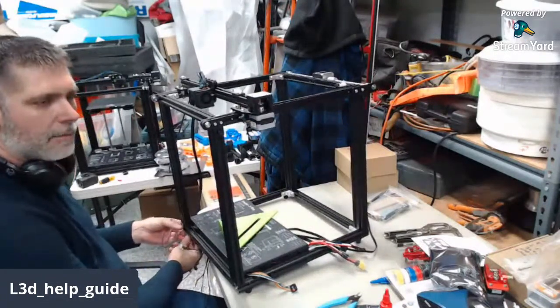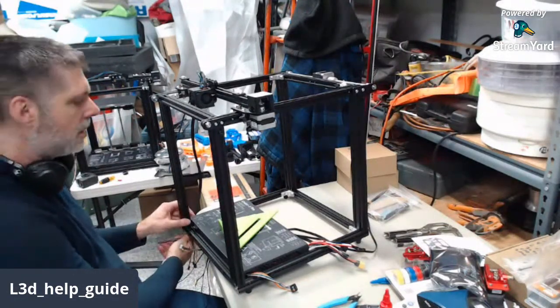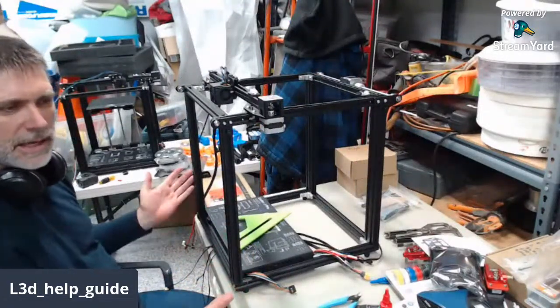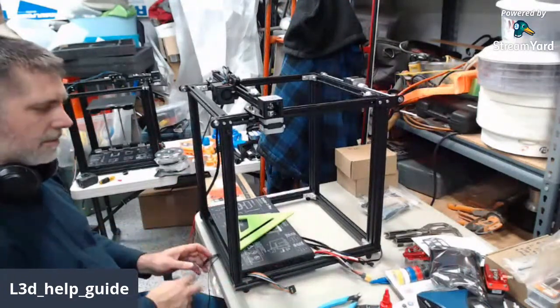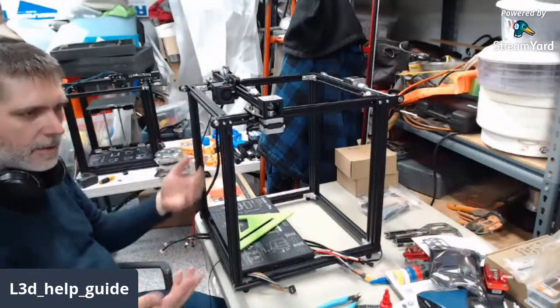That way you won't have that bulging ball end on the end of your filament coming back out, and it won't get caught on the washer. The other reason that people have had a problem with the PLA washer, just print like 4 or 5 of them just in case you have a problem with your heatsink fan. Because if the heatsink fan fails and you have no cooling going on, eventually it'll get hot enough up there to melt the PLA washer.